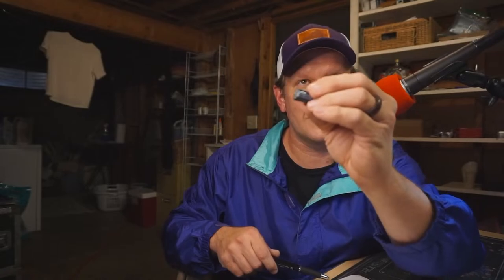The thing is, we're looking at machines that are all past the technical lifespan of the capacitor. Even these good capacitors are technically beyond their life expectancy. So we're at a point now where a lot of these recaps are preventative maintenance, right? Because it's much easier to go in and recap a set and do it properly, and then you just use the set, and most of the time you don't have an issue.